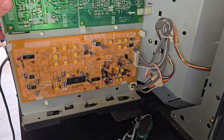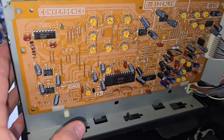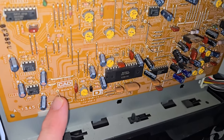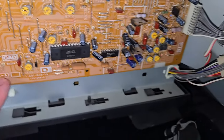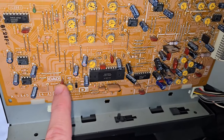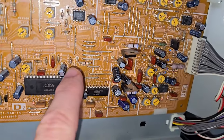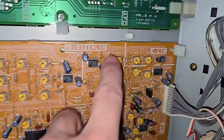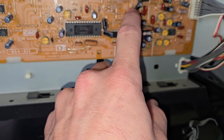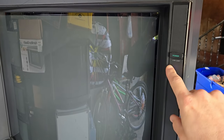I've checked everything out and it looks good inside. There are a bunch of test points on this board, so we'll open it up and test it. If the video doesn't come on, I'll hook my ground wire on my multimeter and use the other test points in this vertical path. I can test for a DC voltage of minus 16 volts, plus 16 volts — both in the vertical circuit — and plus 5 volts. We'll see if we get voltage on those. Should be able to turn the power on now.